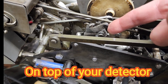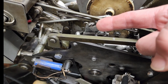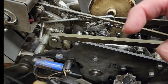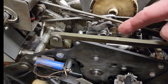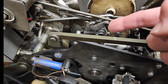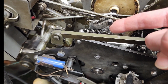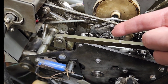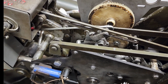Let me show you. Now this is the second ball selector right here. When you're in first ball, you can just push this forward, go to second ball. The newer machines, it's kind of like a C-shaped thing. It's like two C's facing each other. This is the older style. It's a lot easier to put this on second ball. But if you have a second ball solenoid, you can grab that and do it. It's a lot easier than the linkage or the link itself. Mine, here you go. Second ball, there we go. Drops the deck holding hook, pin setter's in second ball now.